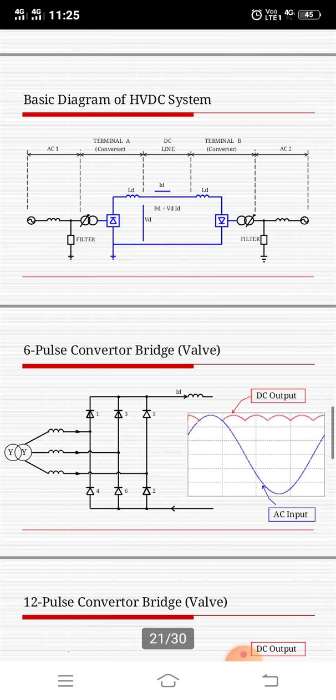The valve firing signals are generated in the converter control at ground potential and are transmitted to each thyristor in the valve through a fiber optic light guide system. The light signal received at the thyristor level is converted to an electrical signal using gate drive amplifiers with pulse transformer. Then the valves are protected using snubber circuit, protective firing and gapless surge arresters. Some of the details of the control and protection of the thyristor valve are discussed later.